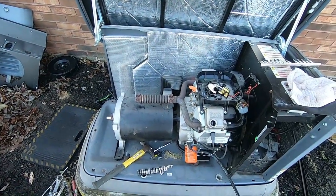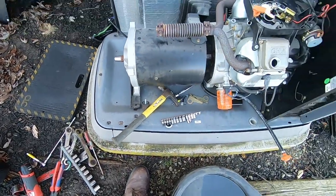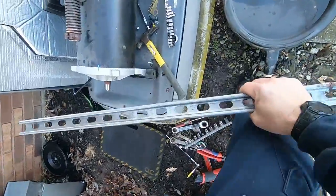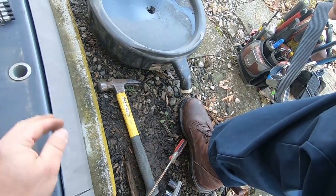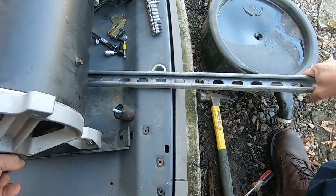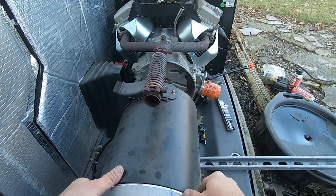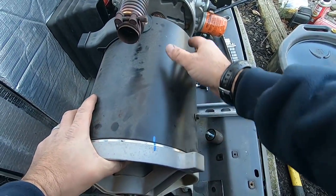At this point I'm just going to pull this off to the side and get it out of my way — no need to take things apart any further than necessary. Mark this with your marker pin so everything lines back up — makes it a little easier. We've got our uni-strut here, just a standard piece that's going to help lift the weight of the rotor and help us maneuver things in and out of the way. Just be careful because your leads are right there on the end — don't want to rip those out. We need to primarily lift it up and get it off of there. This rotated a little bit, so we tap that back on.